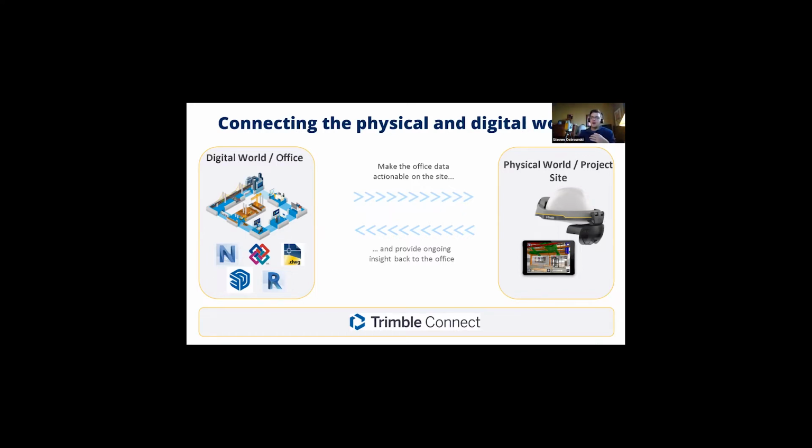them on site. When they're overlaid on site, you're going to be able to capture what we call to-dos, essentially like clashes, where it's going to tie to specific parts of the model. And then anyone who opens that model again is going to see the issues that may be arising on site. And we'll go through that, but it's send the office out to the field with the AR and XR10 apps, overlay it, and then find those clashes and issues and tie it and send those back to the office via those to-dos and images so that everyone within the project can start to see those problems that are developing. That's all run through Trimble Connect.